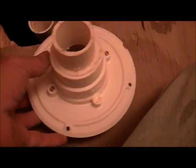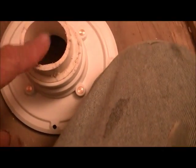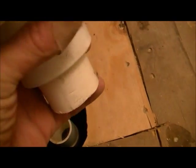What I normally do is, this is specifically meant for a 2-inch pipe, so I run a 2-inch pipe, and if I'm going to make the transition, which I have to, to 1.5 inch from a tub, then I do it as far to the main drain as I possibly can. So I would have a 2-inch P-trap going all along that way rather than 1.5 inch. But that's just me, and so I have to deal with what I deal with.